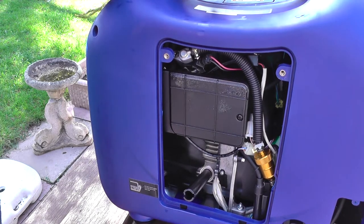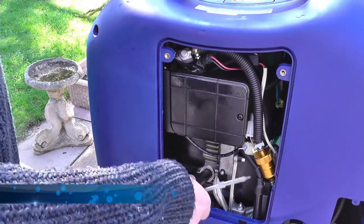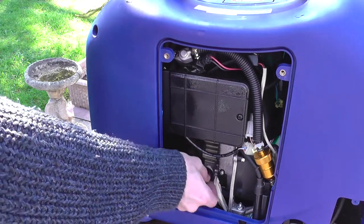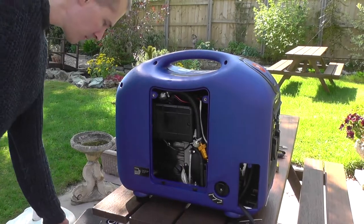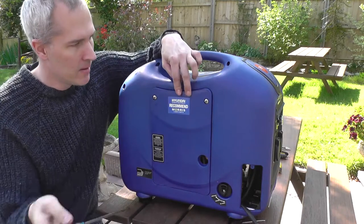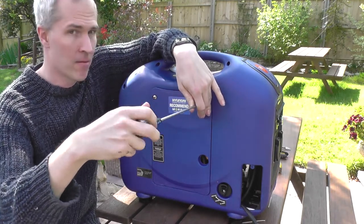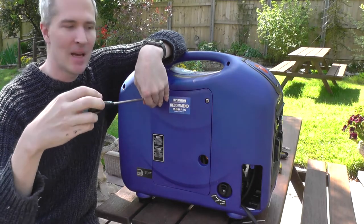When finished, just tip it forward and unscrew it. And check the oil level, that it's just above the top of the lip of the thread. And do up the plug again in a clockwise direction. Next, reinsert the base and do the two Phillips screws back up again. Again, trying not to over tighten, otherwise you might damage the thread.